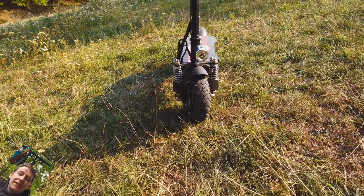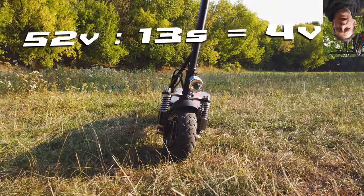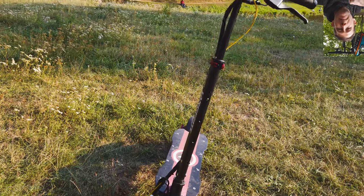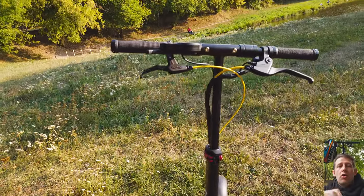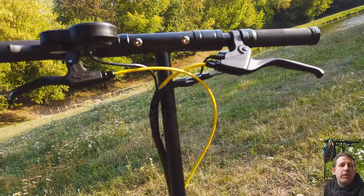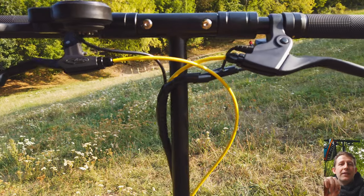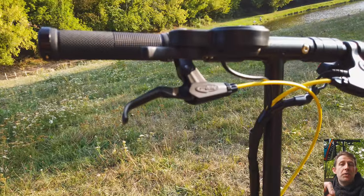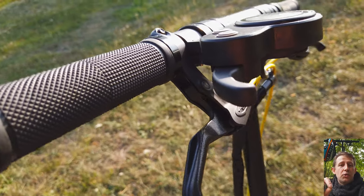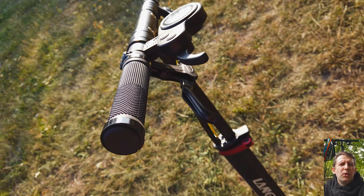How do I calculate that? It's quite easy. You have to divide the voltage by the number of cells. So 52 divided by 13 should be around 4V, because inside we've got standard Li-ion batteries. Li-ion batteries get the best lifespan if you hold them between 3 to 4V. If you charge it fully — around 54V — then every single cell will get 4.2V. The difference in capacity between 4V and 4.2V is only 10%, so you lose only 10% of capacity, but the lifespan will be at least 600 cycles — that's at least 2-3 years.